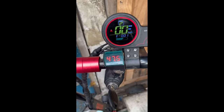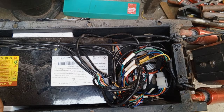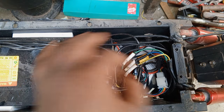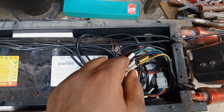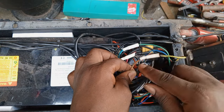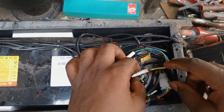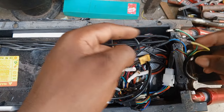Follow me — this is the inner view of the scooter where the controller, wires, and battery are all connected. Since we are suspecting the motor, let's go ahead and test the lines coming from it. Even without testing with any instrument, you can see that the cable looks like it has been very hot, which is a sign that there's an issue with the motor.